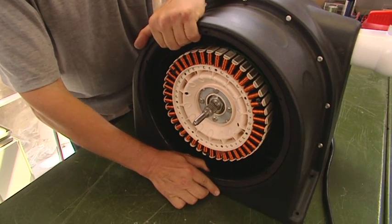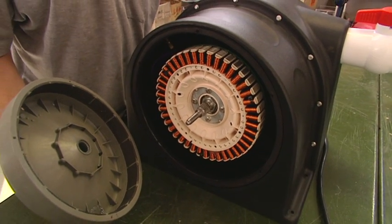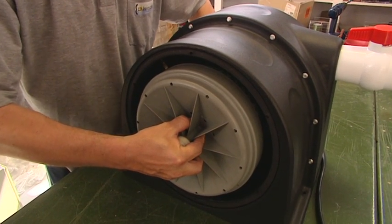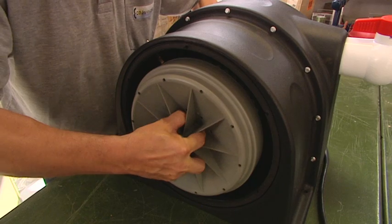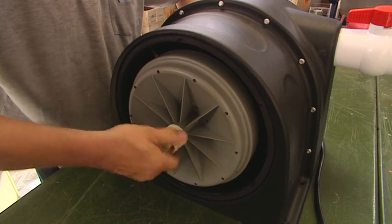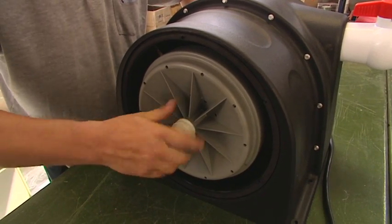Put it in its upright position, then grab the stator and the knob. With your other hand, grab the end of the shaft or the Pelton runner and bring it up and over the shaft. Give it a bit of a wiggle until you can feel that it's seated home — this is why it's useful to have your hand on the other end. Turn it until it's home, then turn the extractor knob clockwise until it threads on to the end and keep turning until it's fully home. Those magnets are now starting to cover the poles at the end of the stator.